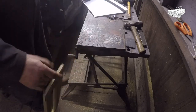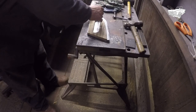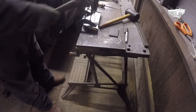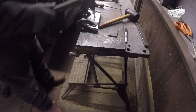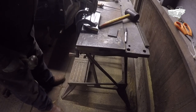Mark out and cut a slot to the required dimensions in your plywood template. Align your plywood template to your workpiece and mark out the slot, then clamp the workpiece and template to your bench very tightly. Then with your blunt bolster and a hammer, mark out the outline of your slot.